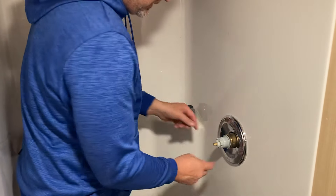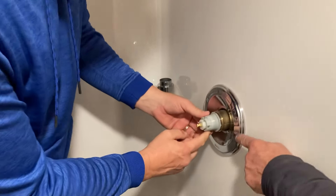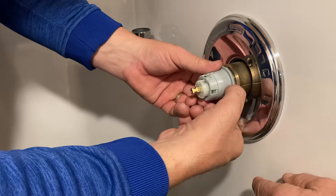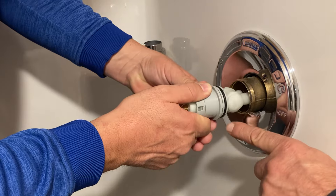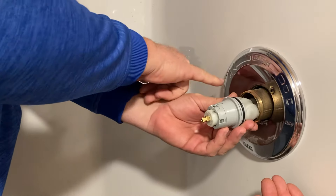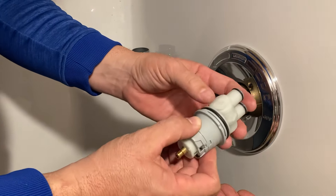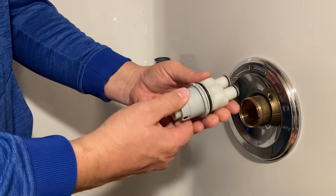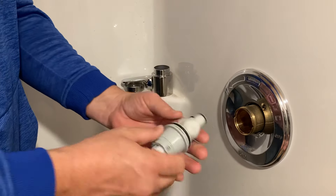This part has a little triangle that lines it up in here — just a little notch right in there. Pull that out. This side is your hot side — you can see it's marked right on the valve itself. When you pull it out it's got an H which indicates the hot side, so when you put the new one back you want to make sure H lines up on this side.